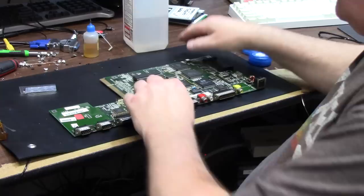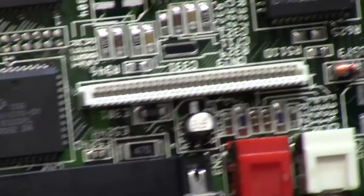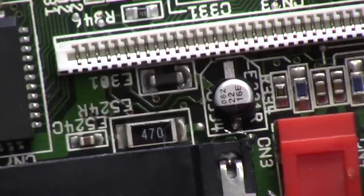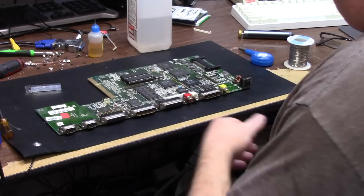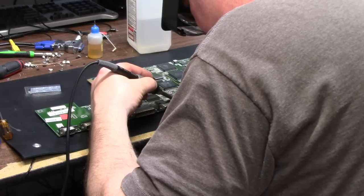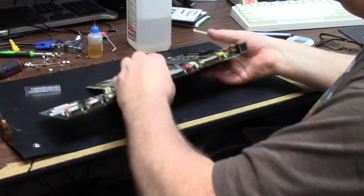Now, the back side is on, okay? And the reason I push it down so far, see how it's down? There's the ball. Gives me all this extra room for that top point of solder. Now I'm gonna do that one. And unfortunately, because this camera sucks and my filming is just epic, you won't be able to see what I'm doing. If I had some kind of magic overhead camera where I wasn't in the way, it's possible you could. But I feed the solder in from one side, touch the pad, and let it eat. There we go. And that is how you do your keyboard cap without screwing it up.